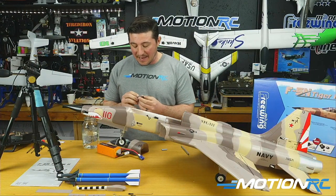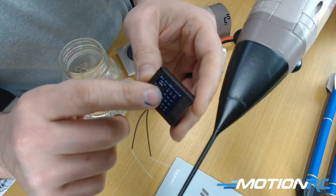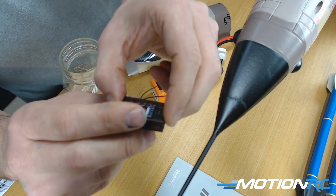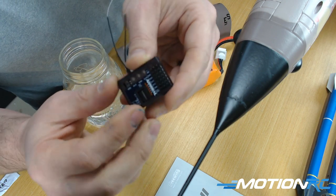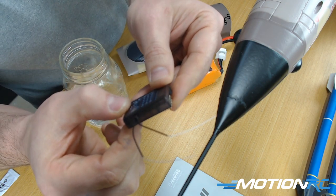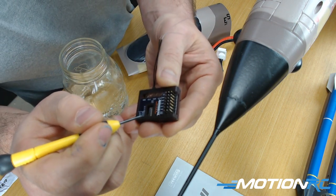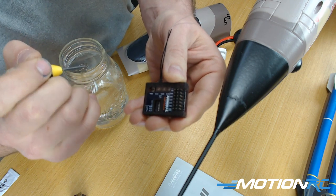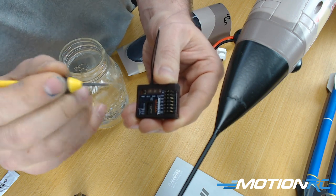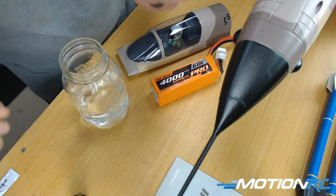So if you come back, normal shows on that screen where you want to go to the dip switches: J4, J5 on, and J6 off. That pertains to the dip switches here. You see J6, J5, J4. So we want 4 and 5 on and 6 off. Right now, they are all off when you get it out of the box. So we're going to go J4 on, J5 on, leave J6 off. Now that is in a normal orientation.